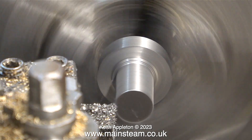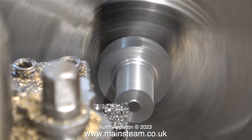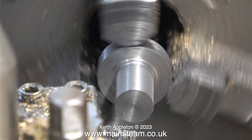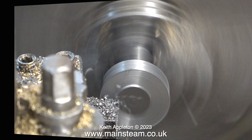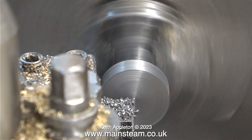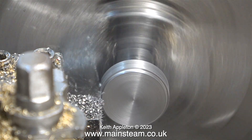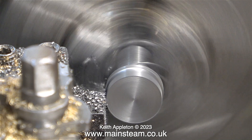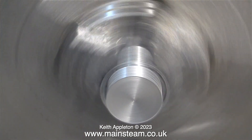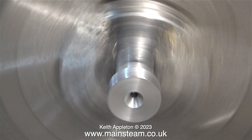I don't want this to be a press fit — I want it to be an easy fit so I can use Loctite 603. By easy fit I mean not tight, not a rattle fit. Anticipating someone removing these bearings at a future time, all they will have to do is heat up the cast iron blocks that support the bushes and no violence will be required. I've turned the part around in the chuck again and I'm turning this part to the finished diameter, which needs to be the same diameter as the boss on the flywheel — it's going to be a lot better than two fibre washers.